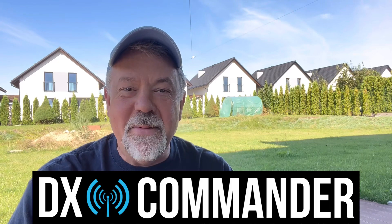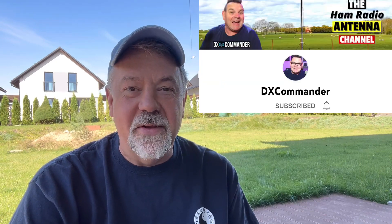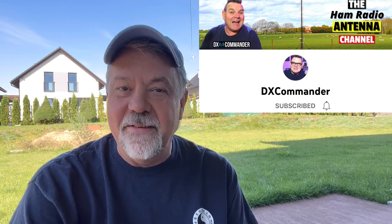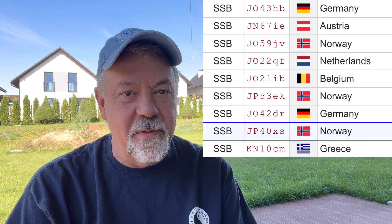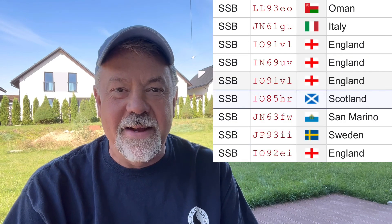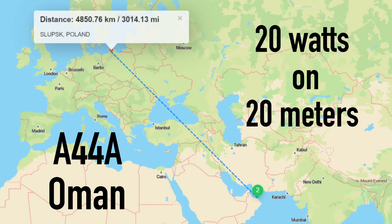How cool was that — Callum, DX Commander! It was awesome. He's listed below as one of my favorite YouTubers and he's got a great YouTube channel. Band conditions this past few days have just been horrible, but with this antenna I was able to work pretty much most of Europe on both 40 and 20 meters. 10 meters was not so great, but with just 20 watts and my Xiegu G90 I could work all over Europe, and I even had a really cool DX QSO — a contest QSO down to Amman, over 3,000 miles away — just on 20 meters.